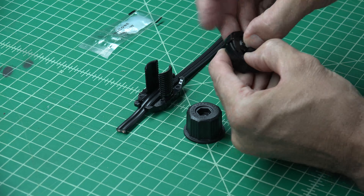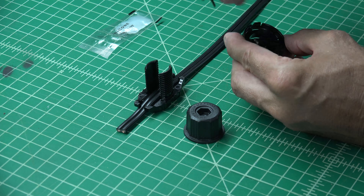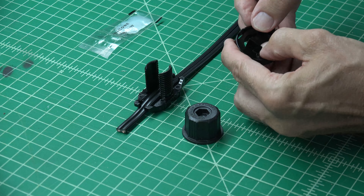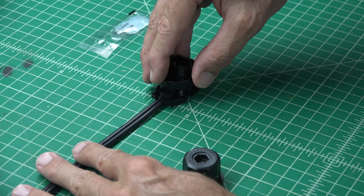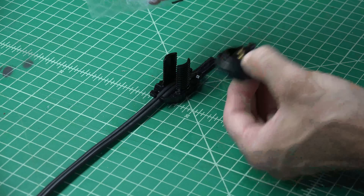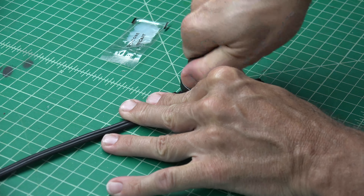In my case I will have a light on each tree in front of my house — one on the right and one on the left. Use your hands to insert the wire into your split to make sure you get the depth of four inches. Once all your wire is laid, you can replace your initial plug and move on to installing your transformer.